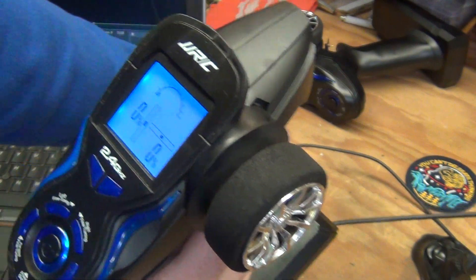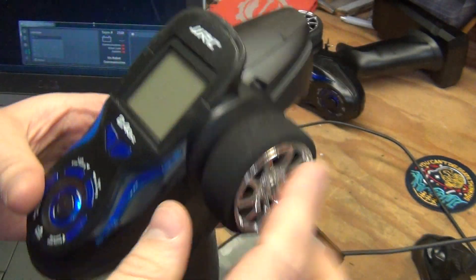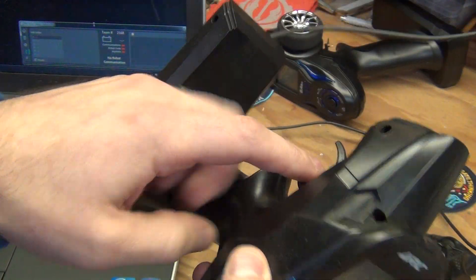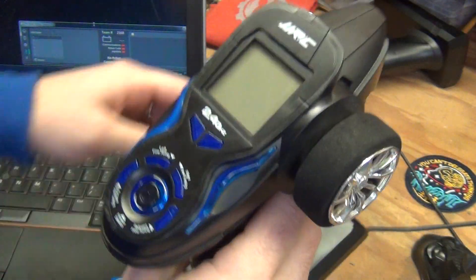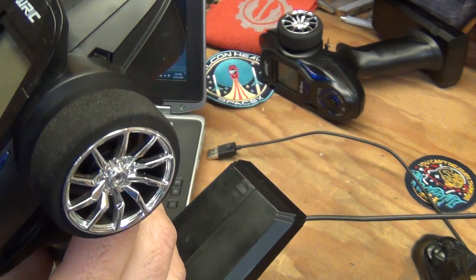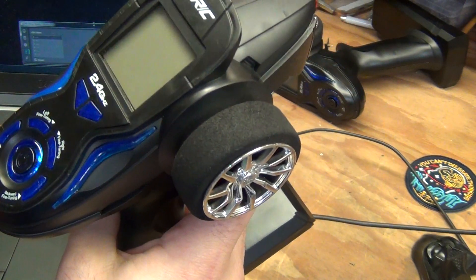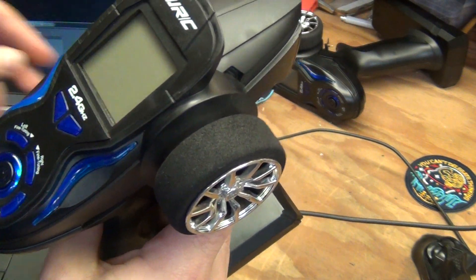There's also a built-in calibration feature. If we had to replace the potentiometers driving the trigger or the wheel, or if the cal data comes out for some reason, or if we have two of these and we want the cal data stored on the devices so they all report their zero and their min-max values the same.